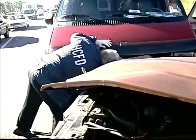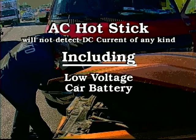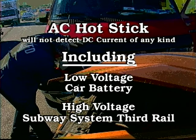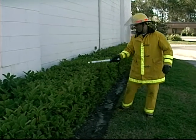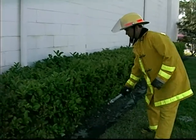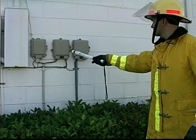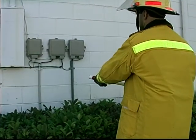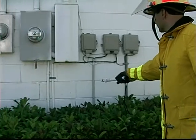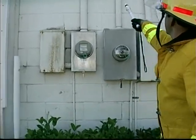It is important to know that the AC Hot Stick will not detect direct current (DC) of any kind. This includes both low DC voltage — for instance from a car's battery — and high DC voltage, such as the 750 volts of direct current found in a subway's third rail. Firefighters use the AC Hot Stick to confirm the absence of energized wires in walls and ceilings before beginning overhaul procedures. It is not uncommon to have power meters or fuse boxes damaged by fire, or even bypassed by people stealing electricity, making normal power control procedures ineffective.